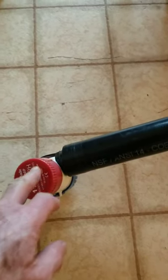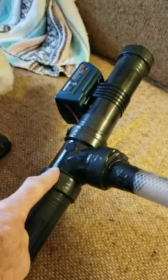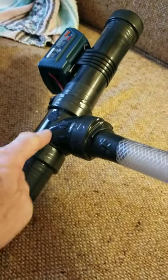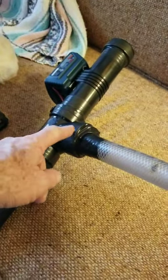So inside this pipe, I've only taped the pipe together and I've never had any issue. I didn't want to glue it in case I had to repair it. So the pump has a 1-inch waterline hose connected to it. This is the outlet. So that's 1-inch waterline, the clear reinforced waterline. And at this point inside, I have a PVC elbow. So again, that's clamped. So the water line is coming up from the pump, straight up the pipe, clamped here to an elbow and then out.